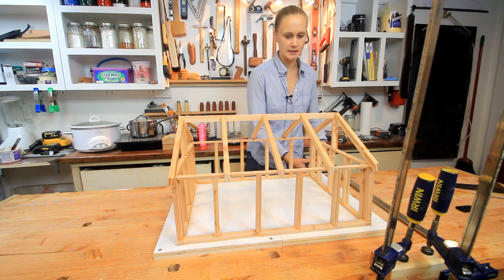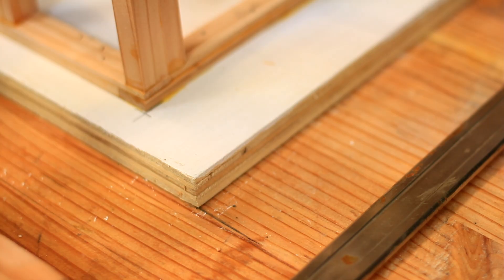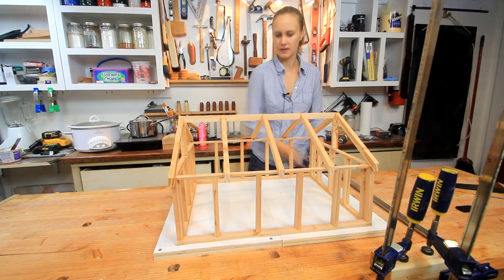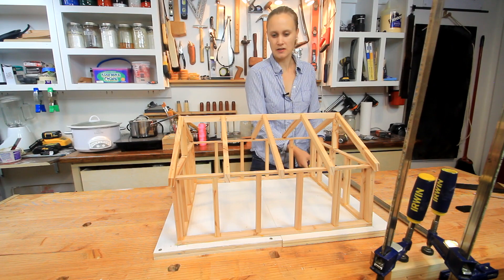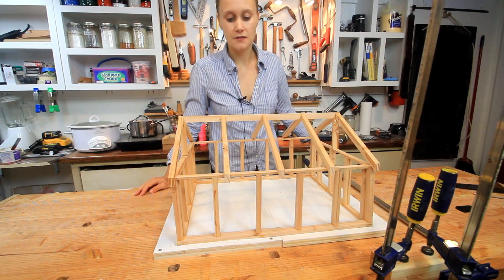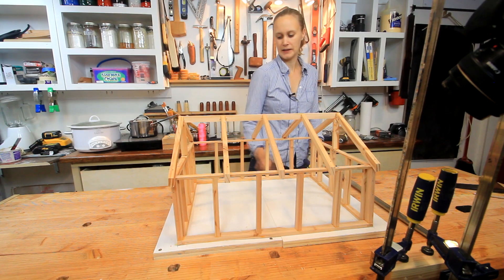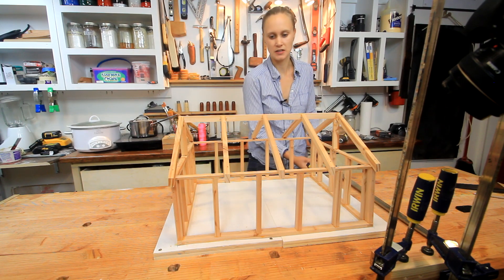So far this hasn't moved nearly as much at this point. I hear a little crack. I see cracking right here. This is much more rigid — it's not failing nearly as quickly, and this whole thing is breaking there now. That's a very different fail point. The whole plate has moved now a little bit. Definitely took much more pressure to get it to that point.